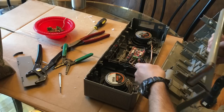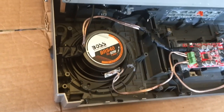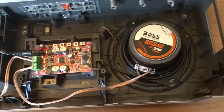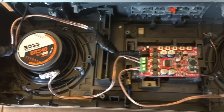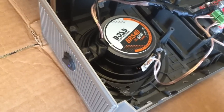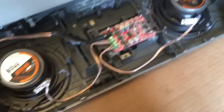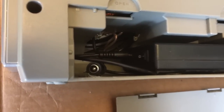Once the case fits, the battery is wired to the board. I also want to show a modification I made after filming this video: I wired in a toggle switch on the left side that allows me to bypass having to control the power through the battery itself. The circuit goes from the battery to that toggle switch to the amp board.